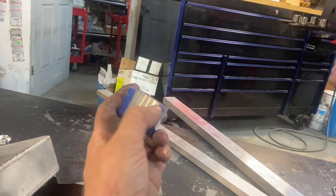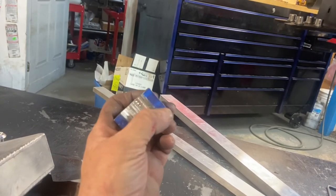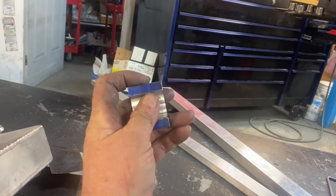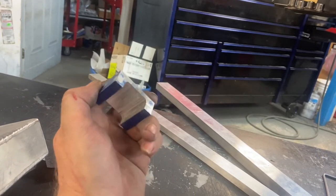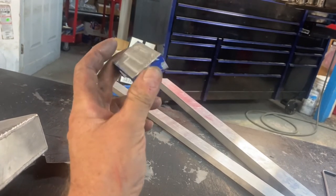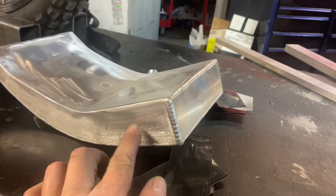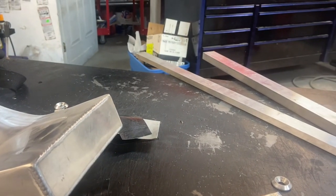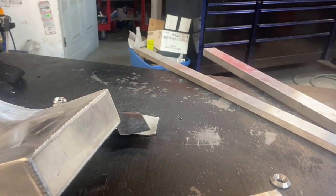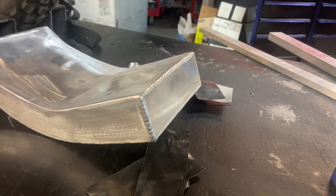Actually there's a bunch of operations that have to be done yet. I have to drill two 5.5 millimeter holes, drill these for M6s — so basically I've got to find the center of that. These are 10 millimeters each. Once that's done I'll tap that on one side, create the mount that's going to go on here, bolt them together, tape up the tank, and then tack everything. That way I know everything is exactly where I want it, and then I'll be able to take it apart and do the final weld on it.